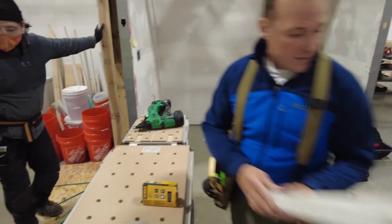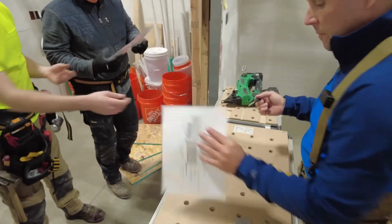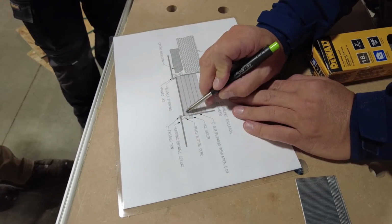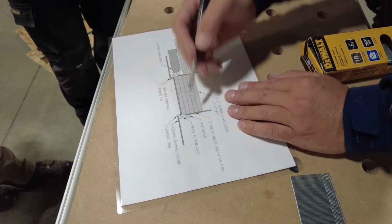Look at your pictures. Let's see one of your drawings there. So you see this right here? This existing trim is on there. It's just regular door casing, okay? And so we're going to put this 1x2 here, so all this weight is now mechanically fastened, and we're going to really secure this. It won't come down.